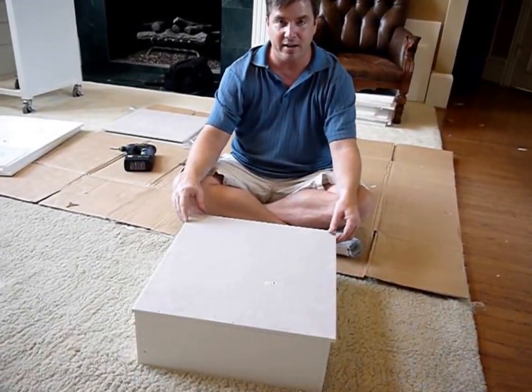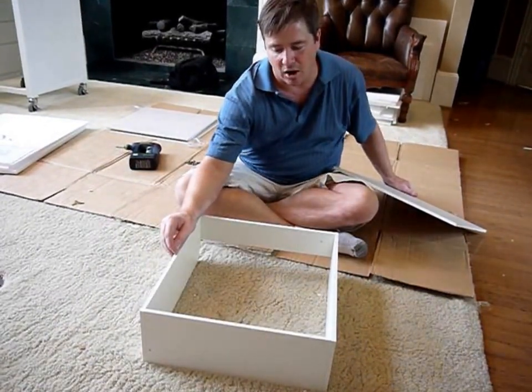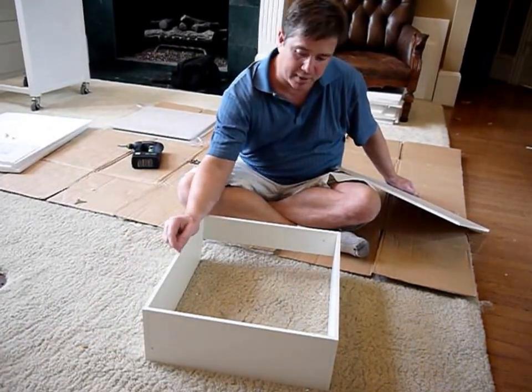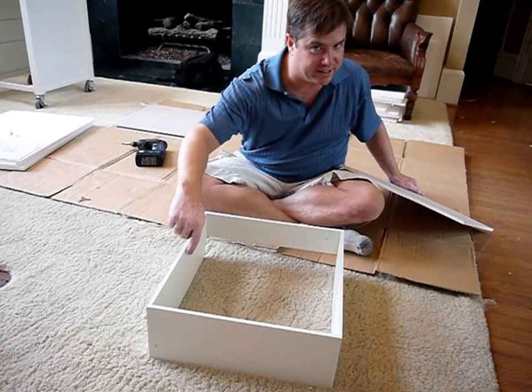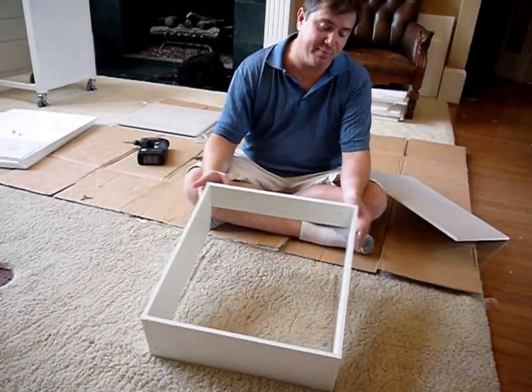But you have to be very careful. The reason is because this wood is pretty thin, and if you were off in between where that hole is and where the sidewall is, if you were over by less than a 1/16 of an inch, it could very easily, or at an angle, shoot over in, and you have a screw sticking in the bottom of your drawer. You won't like that. So here is my little tip in that regard.